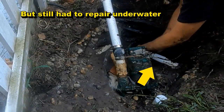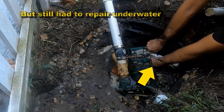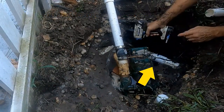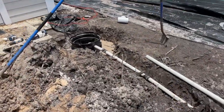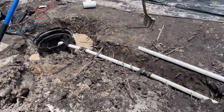It's the same way in the backyard: when you have so much groundwater, you sink one shovel down and you pull out a shovel, but two shovels fall in and your hole gets bigger and bigger. You've got to put the pump down there temporarily and pump that water. Using the sump pump at the same time that we're digging allows us to do this.